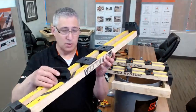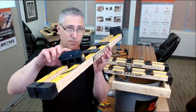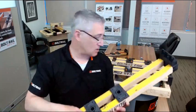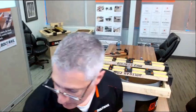Same procedure, we just find the center line of our anchor bolts, mark them on the falsework, find that in our window on both ends, screw it in, and then the rest is exactly the same as you've done here. I'm going to show you guys a picture.